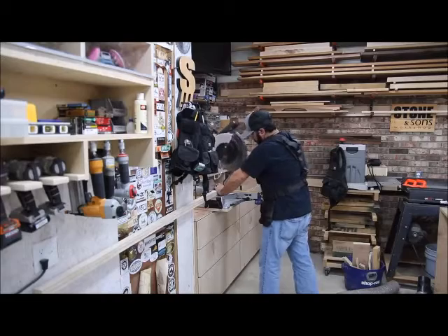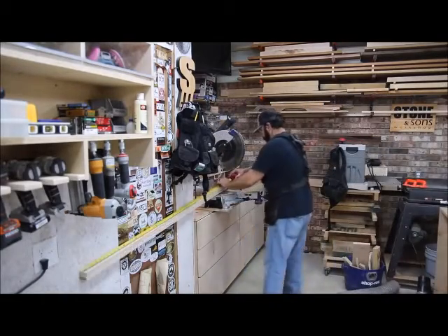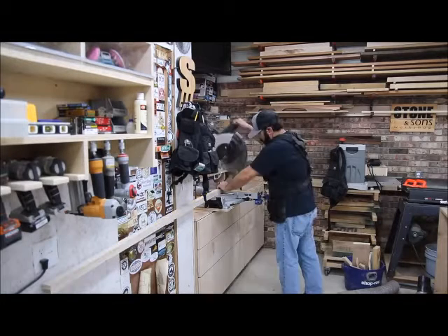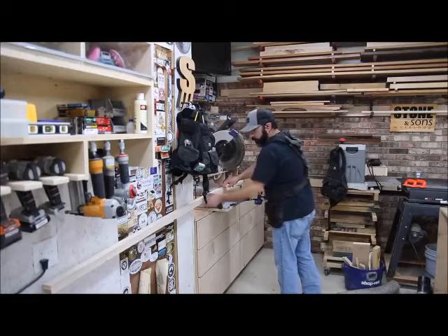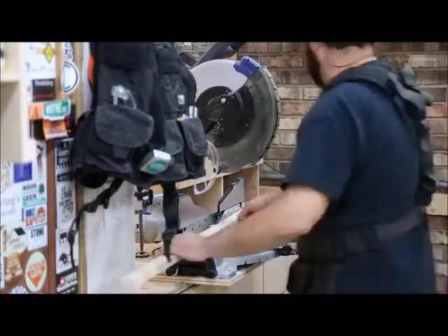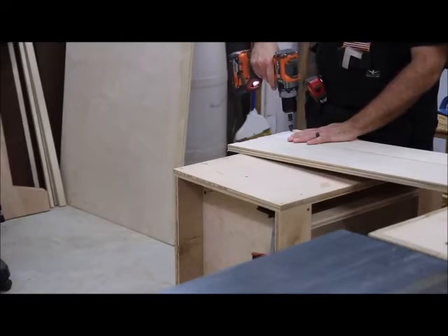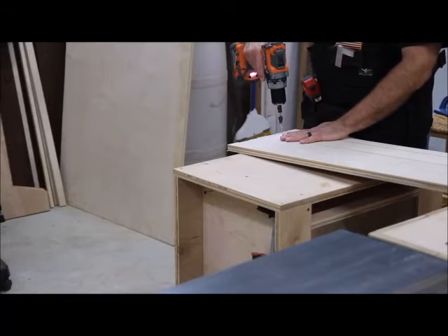With this particular style I'm making the four outside pieces — the two ends and the two sides — but there are going to be some internal parts as well. I've cut down on the table saw a bunch of strips of plywood and I'm just cutting them to length here. This is going to create an internal section of the bed underneath for support — kind of like where the slats would go — but they're all going to be installed beforehand, and then there'll be a panel to go on top.